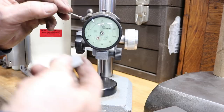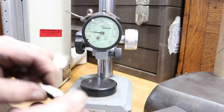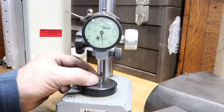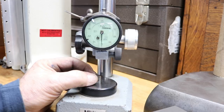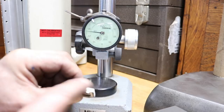We'll just go right through the ones I did here. I just did four, the really bad set that I was talking about. So that's right there, pretty few tenths. About half a thou, so maybe one, just under a thousandth. That one, and that one's just a few tenths high. So that's probably wheel wear on that one. So they're close enough, all within a thousandth.